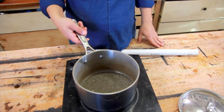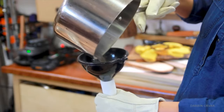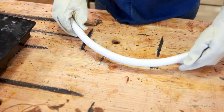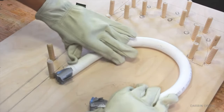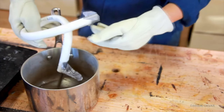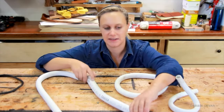Some more tips to share with you this week. Lin from Darbin Orvar has this cool trick for bending PVC pipe by filling it with hot sand, covering the ends, and then molding the pipe freehand or around a jig before it cools down. Compared to using a torch, it's apparently less prone to kinking because the sand inside maintains an outward pressure. The results look cool, especially on small thin pipe.